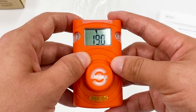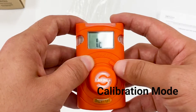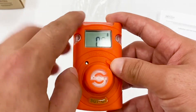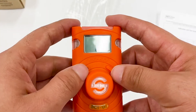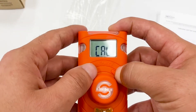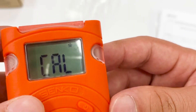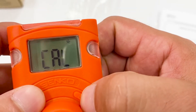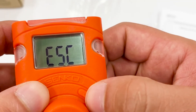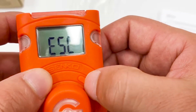Now let us calibrate. The calibration process is also very simple — there is nothing to worry about and it's really easy. When you get to the calibration function, just press and hold the button for three seconds. It will require you to do zero calibration shown by this icon. If you press once more, it will show standard gas calibration. Press once more and it will skip the function.